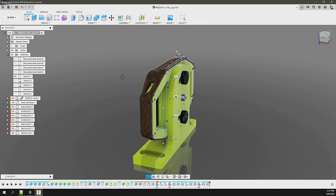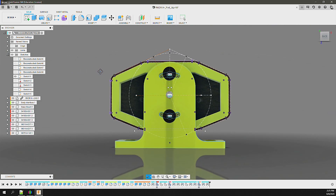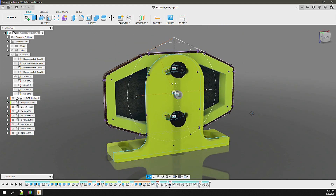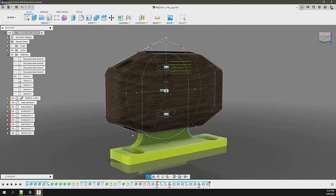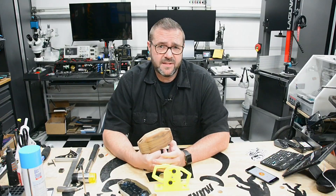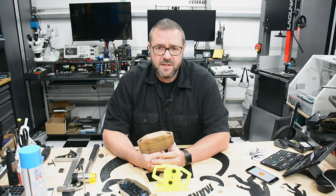I added arch slots to limit the jig's range of motion. For hardware, I plan to use an M5 bolt at the center of rotation and two M5 thumb screws to lock the fixture at specific angles. Last thing was to define the base height necessary to support the rotation circumference — I drew that up, extruded the base, gave it some mount holes, and finished up the body interface so it can be removed more easily. With that, the jig design is complete.